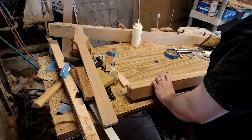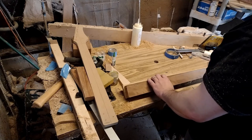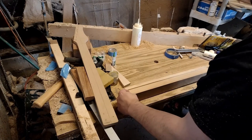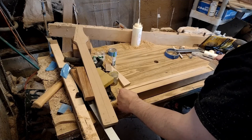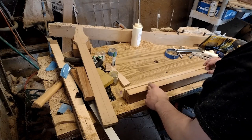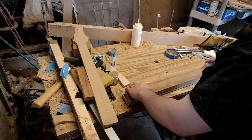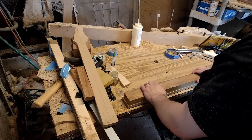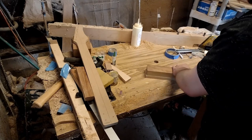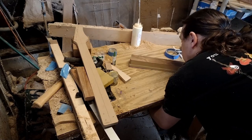Once I start marking this out you'll get a better understanding of what I do. I take one of the sides and mark down one inch — we usually go up to seven-eighths for the depth of the neck route in the body, the neck pocket. After that I mark out three-quarters of an inch here and about five-eighths here and put a taper in. I put the frets in after we install the fretboard while it's still flat. I don't like to shape the neck first; I'll take my chances shaping the neck with the frets in it.